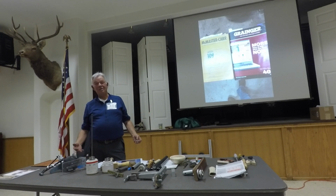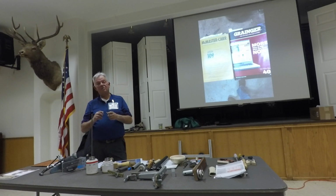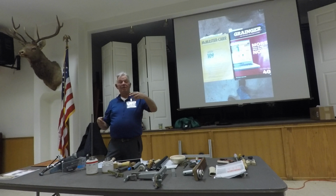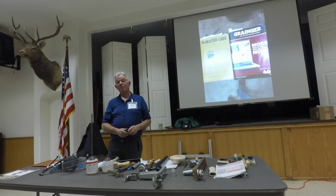Don't worry about buying a cheap Chinese gouge. Buy a good V10 from Thompson, or something from D-Way, or anybody else that makes a really good tool. I think it was in Utah two years ago, the guy out of Colorado who does platters did a whole long study on tools. If you buy cheap tools and sharpen them, and buy good tools and sharpen them, the cheap tools are going to wear out twice as fast. You'll have to replace those, and you'll still have steel left on your good tools.